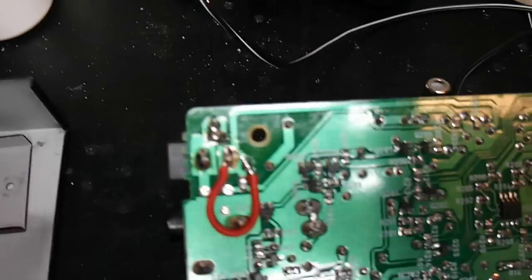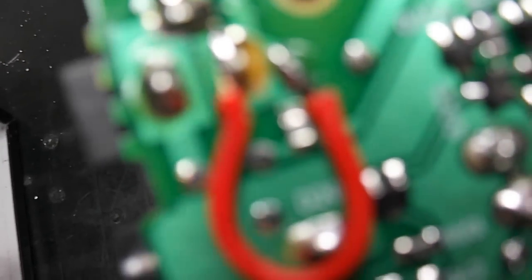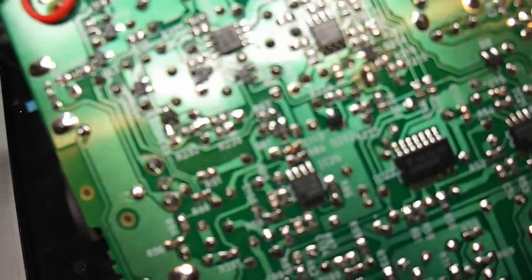When I was soldering this, basically, as you can see there, because of the connection being pulled in and pulled out, it's cracked, well, not cracked it, it pulled part of the board away. So what I had to do is make a little repair with this little lead wire, so it feeds back onto that little capacitor there, and hits that surface mount resistor. But hopefully, touch wood, it should be okay.